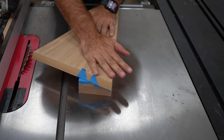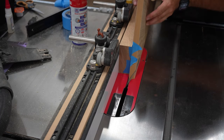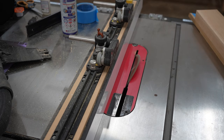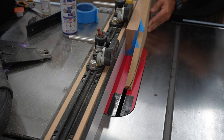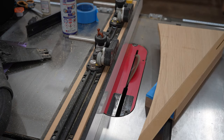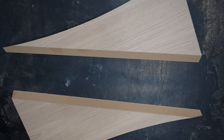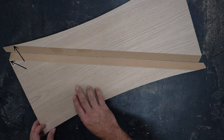As I make the cut, if I didn't use the block, the piece being cut would fall in between the table saw and the throat plate. I started cutting and realized I had the piece glued on backwards, which as it turns out won't matter because I never actually checked the angle on my table saw — thinking I had — but it was at a different angle from a previous project. So all the pieces I ran through all have to be remade. Once I get the orientations correct, they all need to go through the exact same way with the small tip leading into the table saw. Once I have all those recut, it's time to glue them. I set them next to each other, making sure to take one of each variation, and tape them together where the top ply of the plywood runs out.